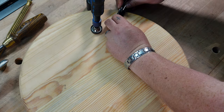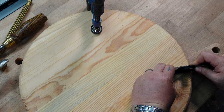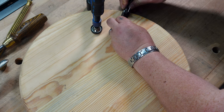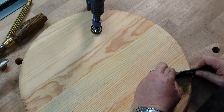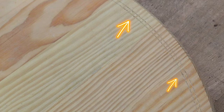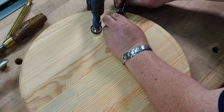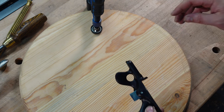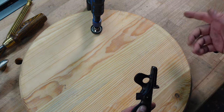See the tear out? I'm going to stop here because I feel my body would need to shift and I don't want to go off course. There's the first little scratch — now we do it again. I'm still not putting any pressure down; I just want to make this line more prominent. You can see all these little micro tear outs — I'll have the camera zoom in and show you. I'm going to keep going and speed up the footage. Now I'm going to start putting slight pressure down. As this line gets deeper it will start following it, but you still want to pay attention — you don't want to go off because then you'll have a tough time getting it back, plus that ugly line.